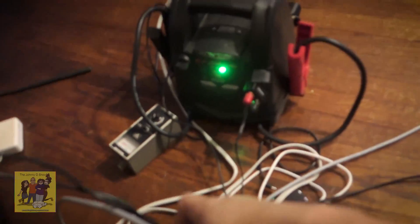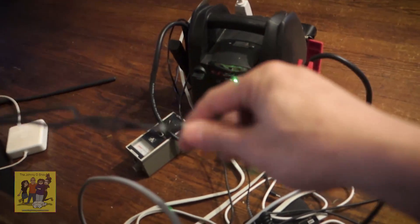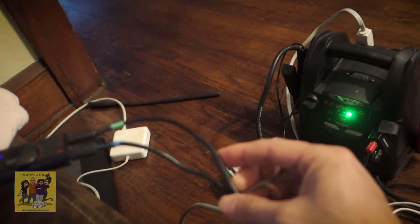I finished the data cable. When I first built it, it did not work. The reason is that when you read the pin chart, those pins refer to the radio — not the cable — so if you're tracing wires from the cable side, everything is reversed. I re-soldered the cable, removed the 9600 baud connection, and also removed the push to talk since you'll want a CAT cable for that anyway. I heat shrank it and wrapped it with electrical tape, so now it's just two wires: data in and data out, running to the external USB sound card.